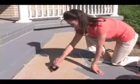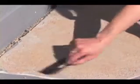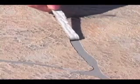With your stipple texture created, lightly knock down the tips with a plastic smoother in random directions. This will create a beautiful stone or tile-like appearance. Sand the texture if desired. Perform an optional color wash if desired. And peel up your grout line stencil. There you have it, a beautiful walkway, balcony, pool deck, porch, and more.